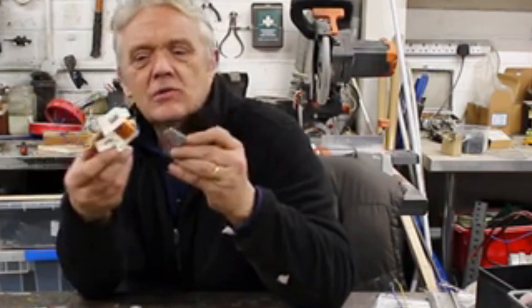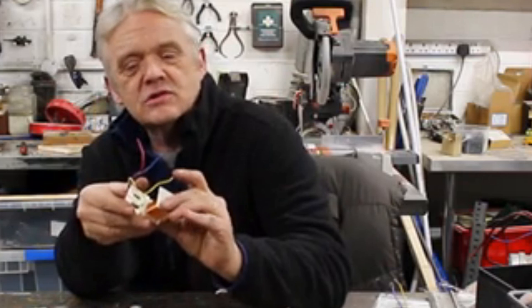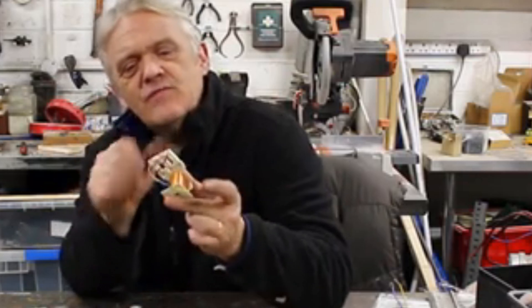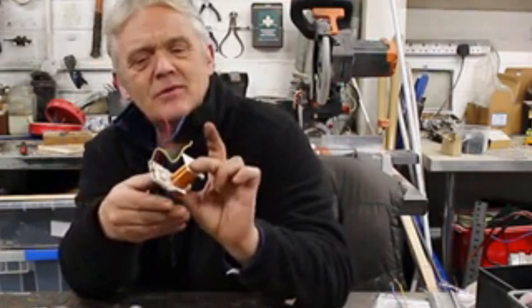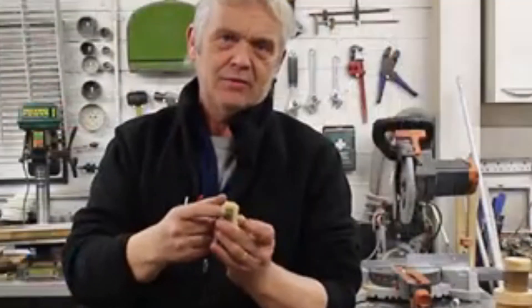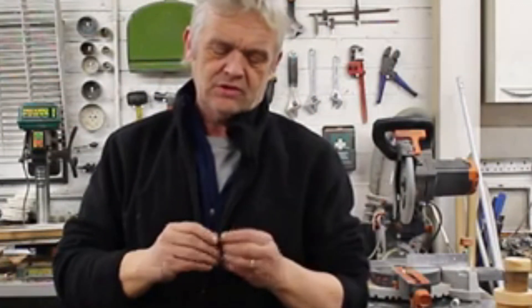What we're interested in is this piece, and in particular the steel that comes with it, because this is silicon steel meant for magnetic applications. The wire in here is as fine as hair — it's impossible to work with, so you want to be careful to leave that coil intact. We can make an adaptation of that to make a balanced armature. Inside there is a little lump of silicon steel, and if I press that out I'll get this, which I can use for my armature.